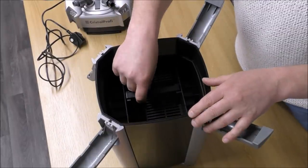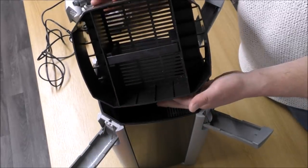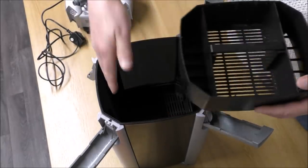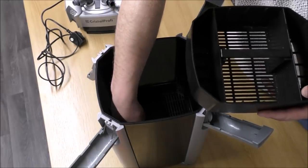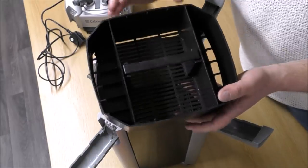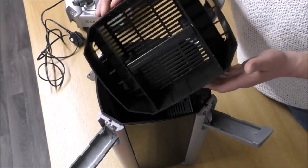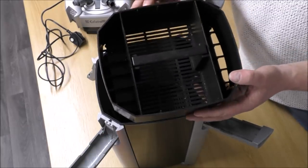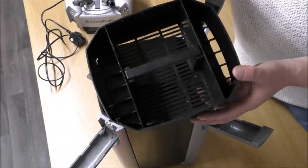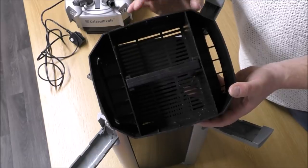The first thing we have is something called a pre-filter tray. The water hits these side sections first, heads down the side of these trays, and then rises up and back out the middle of the pre-filter. So knowing the movement of the water, we need to set this up properly to be most efficient.